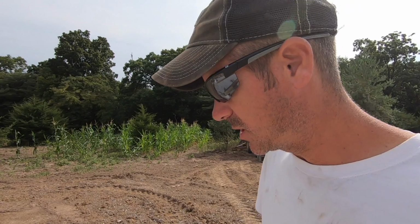But just to show you how I marked these, I set my laser level to my finished floor height, and I just knew where I wanted that based off building my storm shelter. I know where I want my finished floor to be, and it's going to be the same in the garage and the house. I know I want my post to be down 6 3/4 inches from the finished floor. So then I went around to each footing and put my laser level on there to see how much I was off.